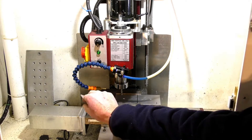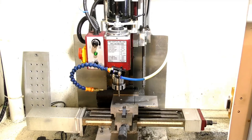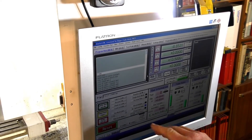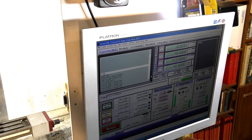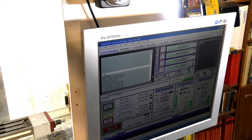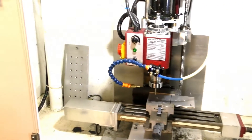Remove the bit of paper. I'm going to be using flood coolant, and I'm sure a lot of you are going to tell me — you had the wrong file in there. And you're absolutely right, I've just changed the file now to a pocket. You'll notice it's the pocket one. It really doesn't matter — the zero zero doesn't change because I did it with the correct tool. So we all make slip ups now and again, trying to be camera operator, light operator, and operate the machine as well. So we've put that right.